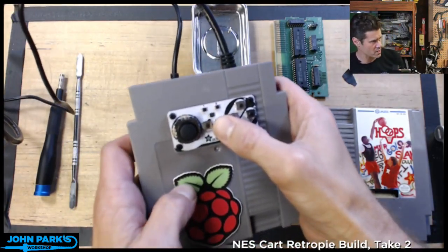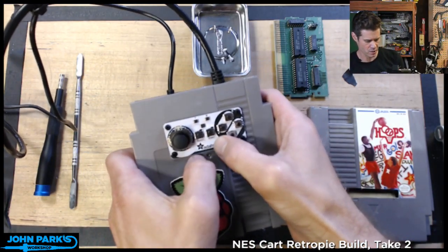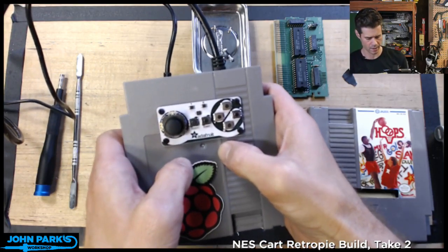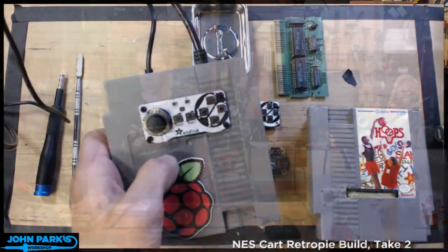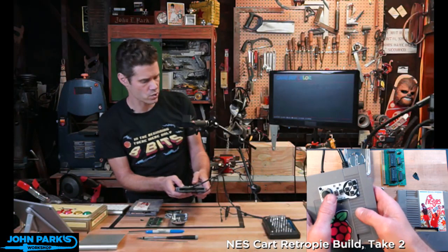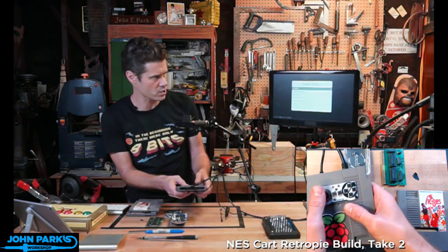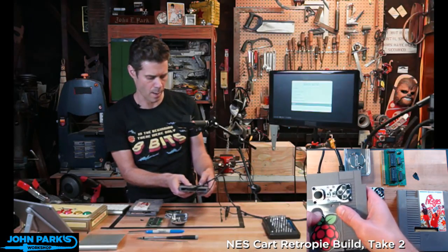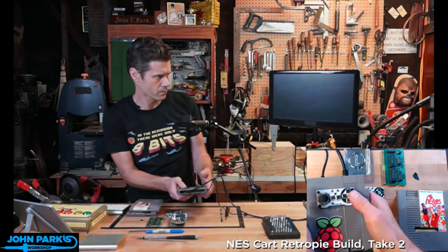I'm going to go ahead and shut this down. So if you press both the select and start buttons on here, it will jump the screen back out. Oh, did I just play? No, you saw me playing. Let me switch back to this view here. It will go back out to the menus, and if you press the start button, it brings up this emulation station menu, and I can go and do a nice proper shutdown. So choose quit, shutdown system.